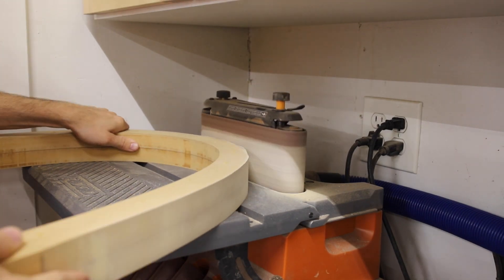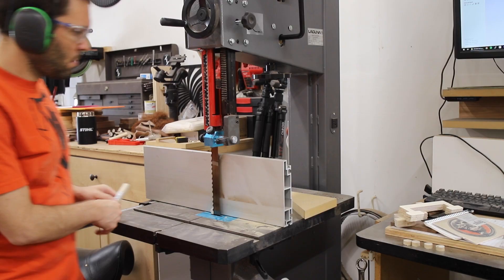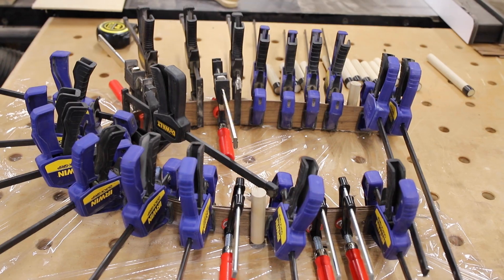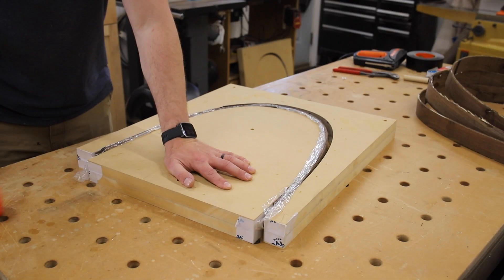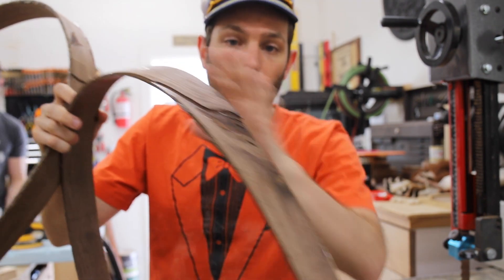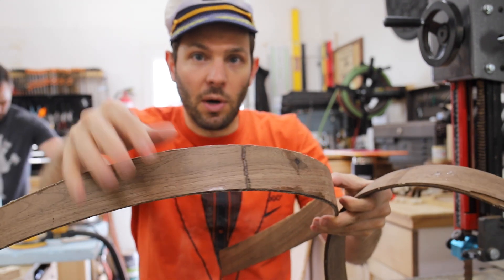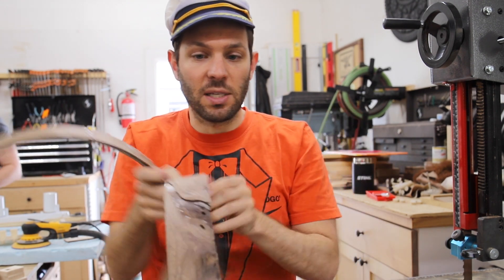Let me know what kind of fruit you would pick for the rebrand of our fun-loving friends in the comments. Back to our prude little pineapple palm leaves — or as they prefer to be called, crowns. We're doing a walnut glue lamination, which is much easier than steam bending, and there are two ways to go about it. The first is with loads of clamps, but using a form helps with both the compression and tension of the wood and leads to less cracking. The plan is to make two different leaves out of each curve, and because some of them split when we're gluing them up, that's going to work to our benefit because we want some long and some short.